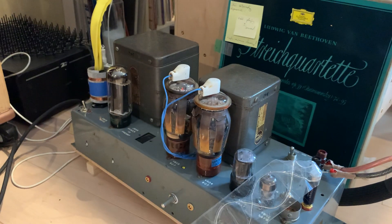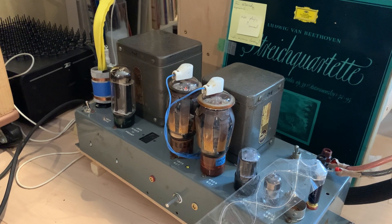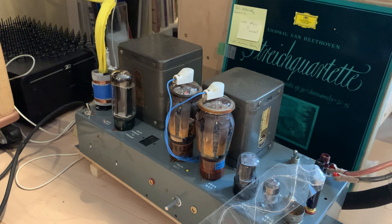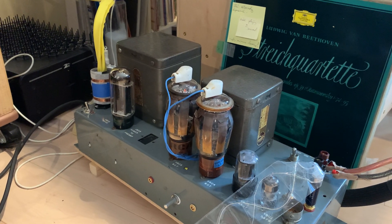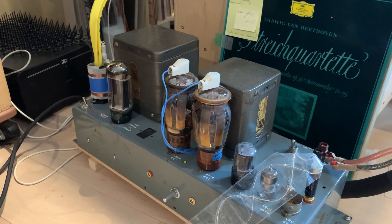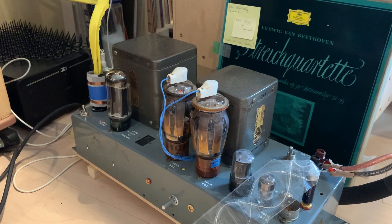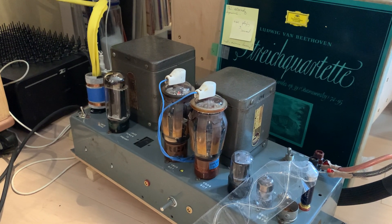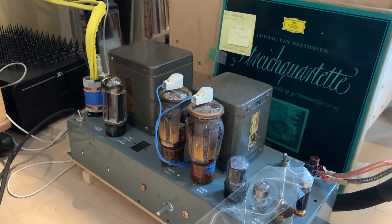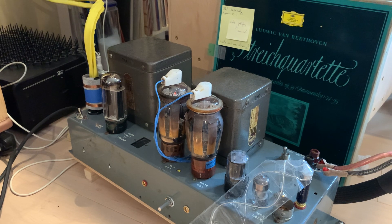Yes, if you have an excellent quality power transformer with extra shielding — maybe a Faraday cage — that will much improve the situation. But even in that case, having such a high-quality power transformer plus a separate high-quality filament transformer will still be superior to using just a single piece of iron. So, if you have a power transformer with internal shielding and a copper screen, your next step is to add a separate filament transformer. That will take you almost to the same level that a nice but very expensive shielded unit would have.